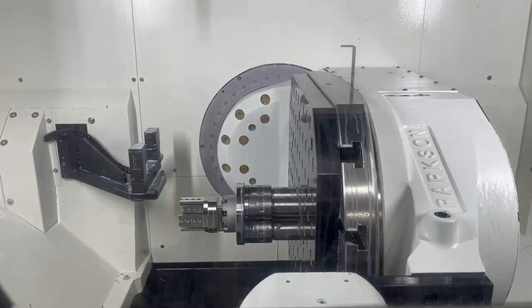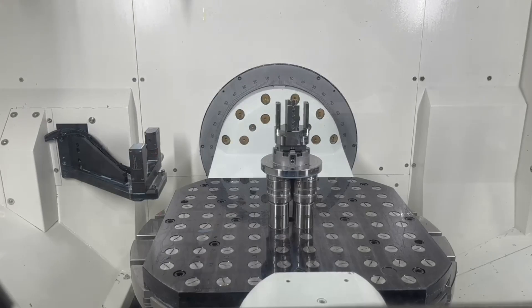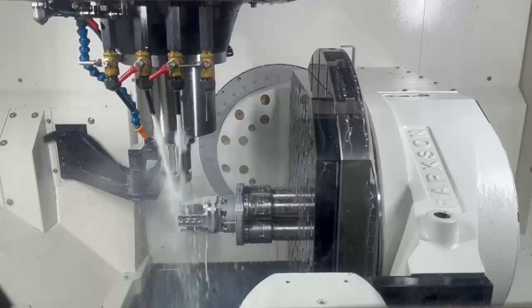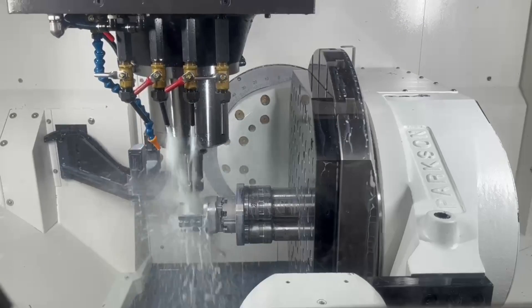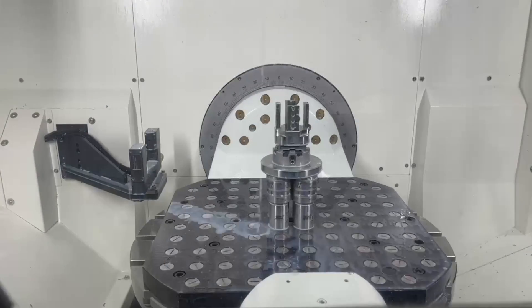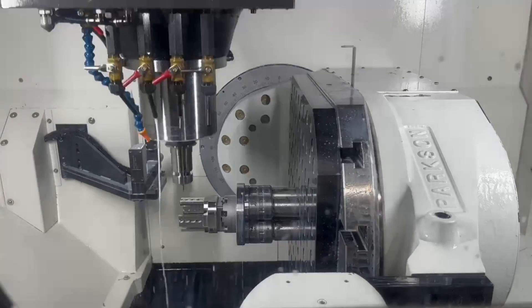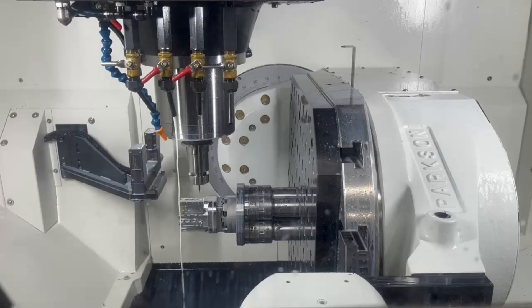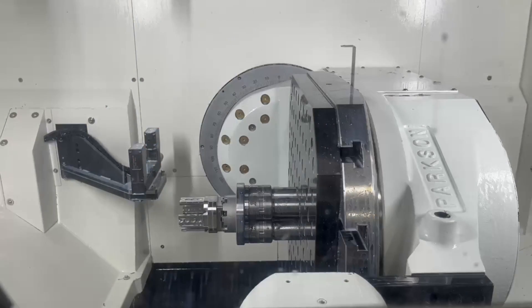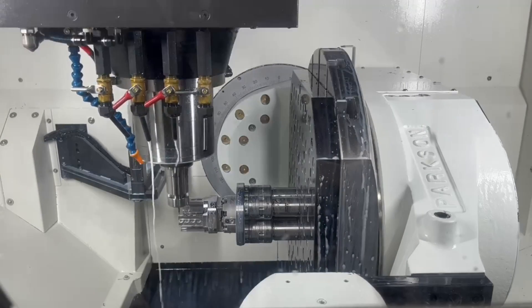If you notice in some of the machining we will show, it's our tool change and our rotations — we always move the cutter out of the way. We're usually making one piece or one insert and we've got to make sure that it's going to be perfect. Most of our cuts have been what's called 3+2 5-axis, which is literally rotating and then using 3-axis machining in a 5-axis machine. This is the majority of the work that you see and mostly what we do, trying to hold high-tolerance mold components, inserts, and cavities and cores.